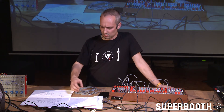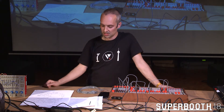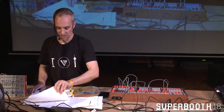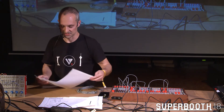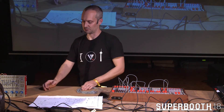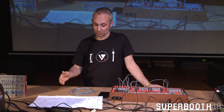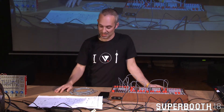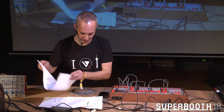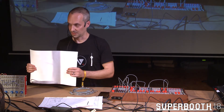I started working with a different clock design and was able to come up with something that could do a slightly wider ratio — 20 to 1. I decided to try using a different memory system: a FIFO — first in, first out — also a serial memory similar to what Don used originally, but in one chip where I can get all eight taps out of one chip. I went with one that instead of having 5,000 stages had 32,000 stages, and clocked it much faster — going from 200 kHz to three and a half megahertz.